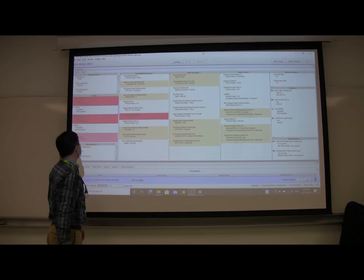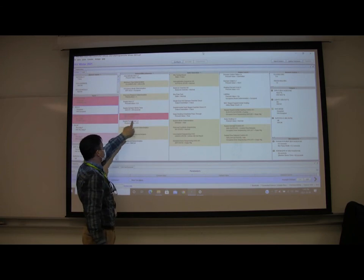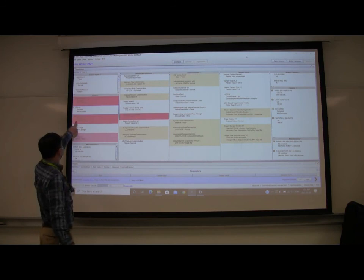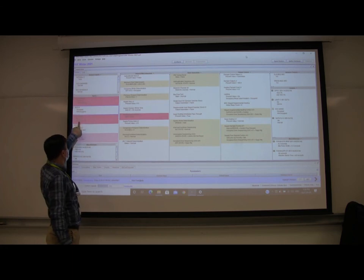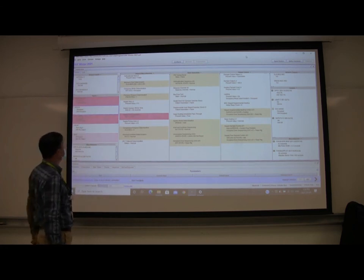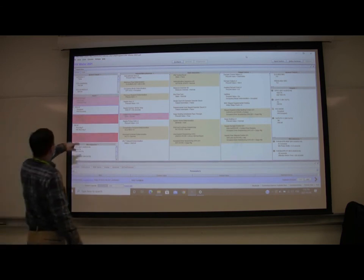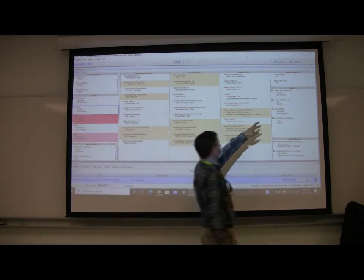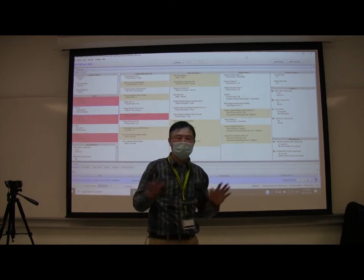Discharge air velocity pressure is zero. And here, they get smaller. Now I use my hand to heat the supply air temperature sensor, so the temperature goes higher. This supply air temperature also gives a signal for the damper control. So this is how to commission the program.